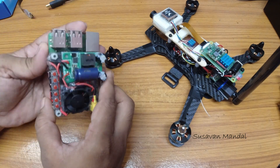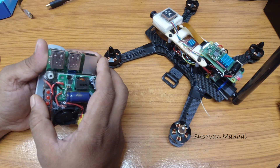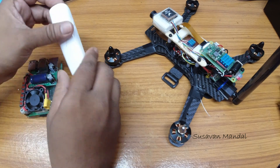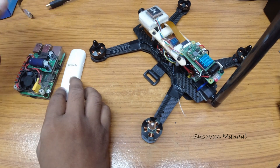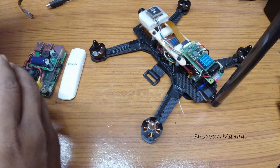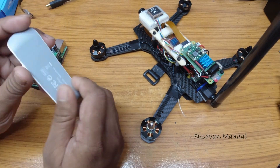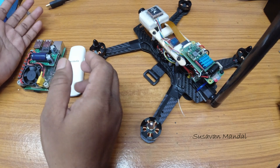I am using a BEC to power this setup. The good thing is that you can use multiple Wi-Fi adapters for redundancy, and combined with some high gain directional antennas, you can achieve very long range. These cards are very low power — less than 100 mW. If you want longer ranges, you need high power cards like the SS-AC56 or the Alpha 036-ACH. With these small low power cards I am currently getting around 700 to 800 m of range.